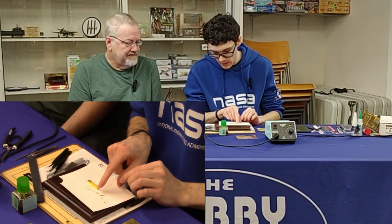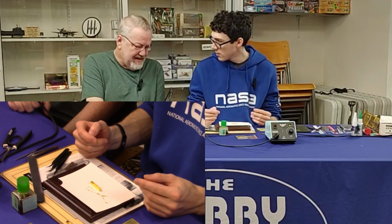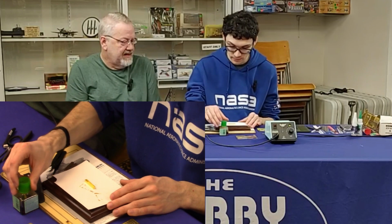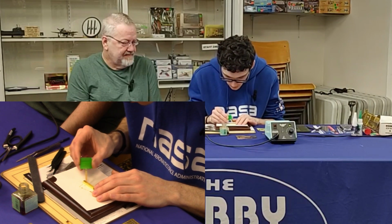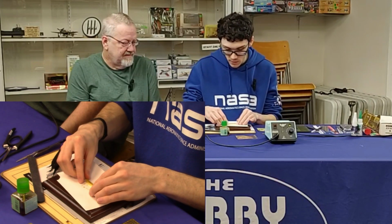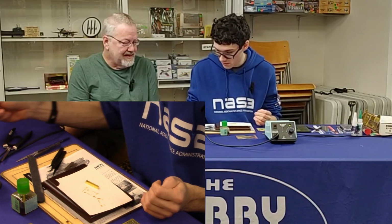Now, will you solder, like, let's say for example, this angle here you just bent? Would you solder that to reinforce it, or just leave it? You can. You don't really need to on there because you already have both edges of it on the bottom. Now the edge that you mated, over here, that's going to be the first point that you solder to hold the whole thing more in line. Okay. Just applied the flux all on the inside joints there. Yeah. And now we will just solder it up.